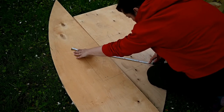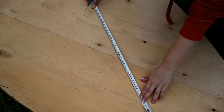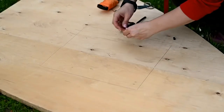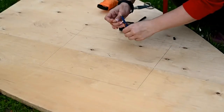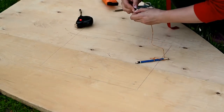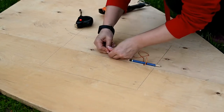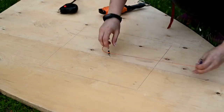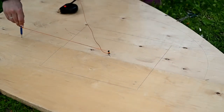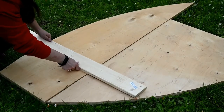The size is not enough to make the entire top, so I'll make the top out of two parts. I'm placing two pieces of plywood side by side, placing the stool on top and marking where it will sit with a pencil. Then I'm marking the center of the resulting square. I'm making a simple compass — tying a thread to a pencil, the other end to a push pin — and drawing a circle. I'm going to make the tabletop about 30 inches in diameter.